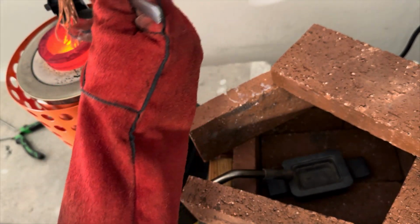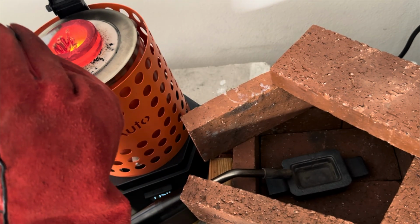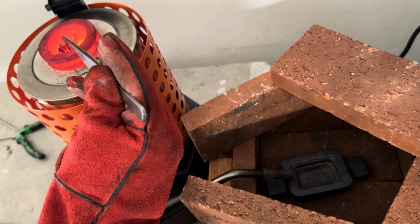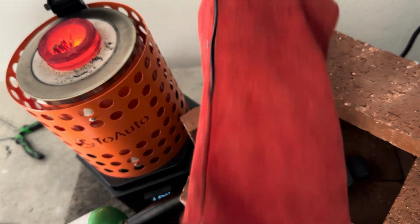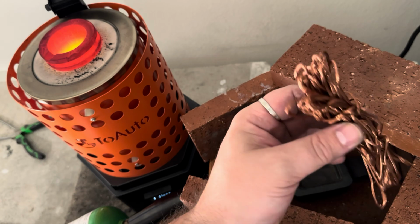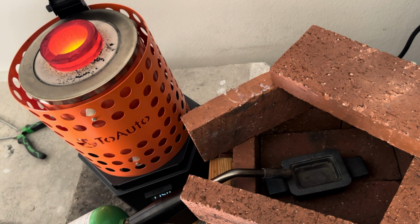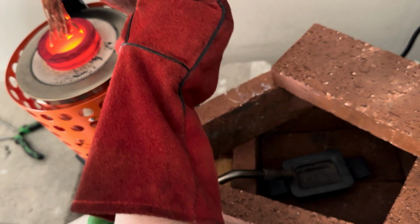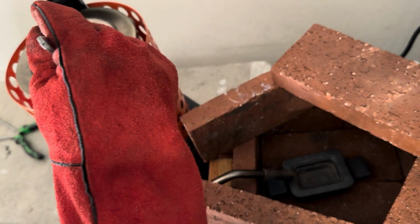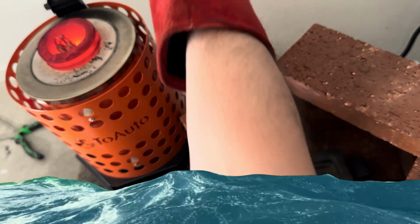Inside that crucible, the copper's bubbling like lava. It's dense, reactive, and when it gets this hot, it wants to oxidize. You've got to work fast and focused. I stir occasionally with the graphite rod, and if I'm melting a lot of copper, I'll skim slag off the surface as needed. Graphite crucibles don't last forever, especially with copper, and if you're doing this regularly, expect to rotate them out every 10 to 15 pours, depending on how aggressive your temperatures are.